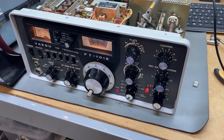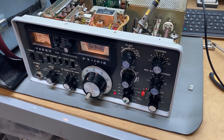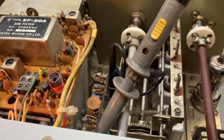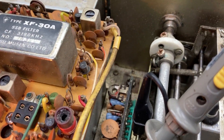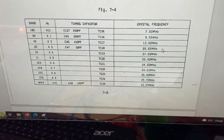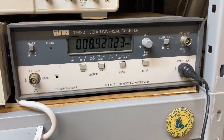This is the FT-101E that I've called Mo, and I'm not getting receive on quite a number of the bands. I've been investigating what the situation is, and what I've got hooked up today is a frequency counter going to the test point of the RF board — I'll just come down there so you can see where that test point is. There's a ground to the chassis, and currently I'm in the 80 meter band, checking the crystal frequency. As you can see, on the 80 meter band it's moving all around the place.